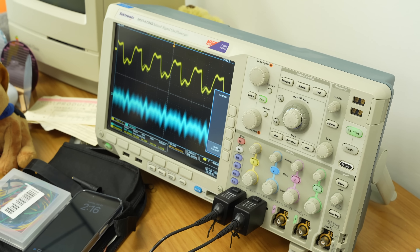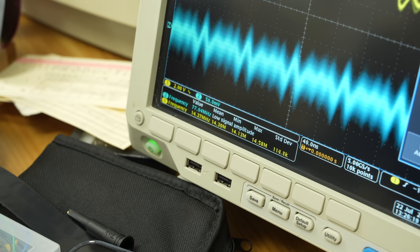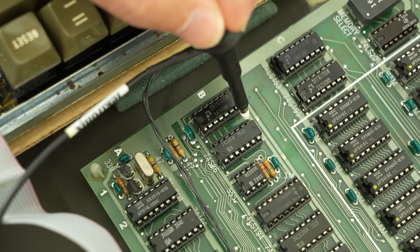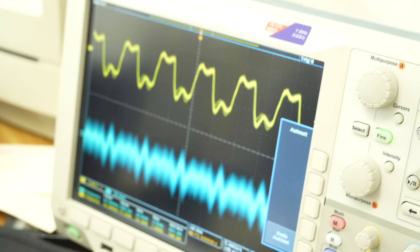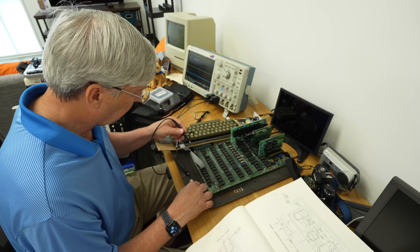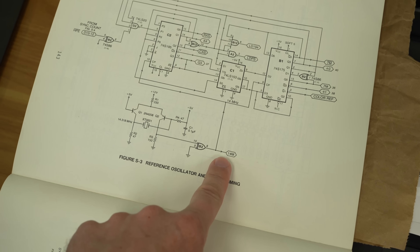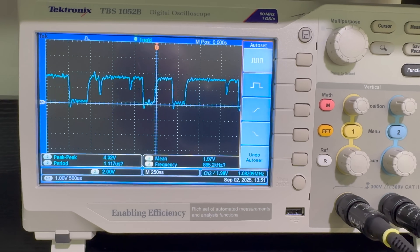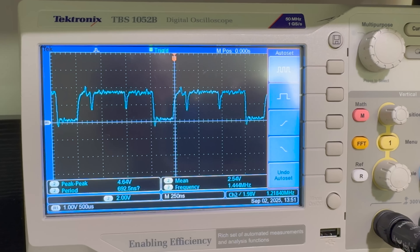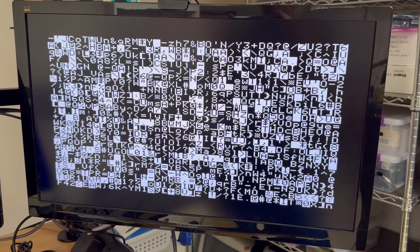It's been a long time since we troubleshot anything like that. If someone out there is deeper into Apple II lore — it seems okay because you're getting a rising edge at more than five or six volts for the clock purpose, and it all followed the spec. On the memory pins you can see activity on the different register pins, but the question is whether they should be more quiet. I've been posting issues on GitHub — all the different things we're testing, pictures and references — mostly because I forget this stuff, and a lot of people have said it might be the RAM chips.